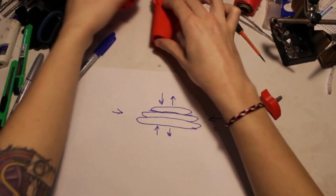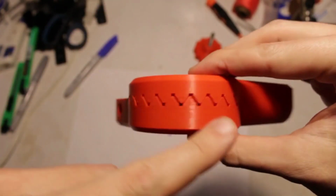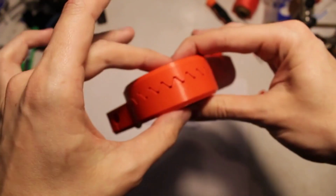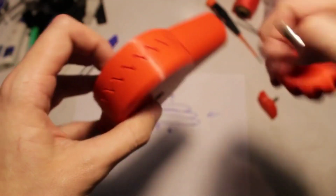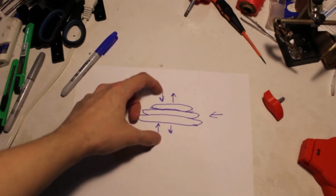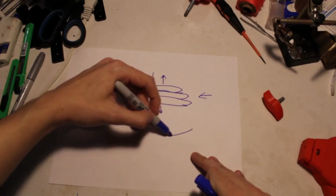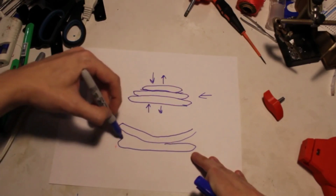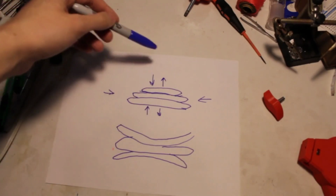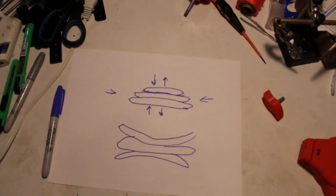So what that means is, if you look at these teeth real close, focus. The layer lines run with the teeth. So let's say if there weren't any teeth, and we just used the clamping force of this knob right here to squeeze these parts together and hold. Why is that weak? Because it's pulling, like we said, it's going to be compressing. Now, compression is better than the tensile, but what happens in the compression of these layers is that they'll want to buckle and separate like that. And like I said, that's better than the tensile force pulling it apart, but it's still not the best, because even a nominal amount of compressive force, just tightening them together, is going to want to separate like that.